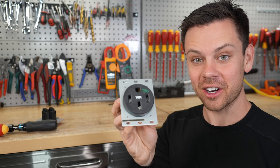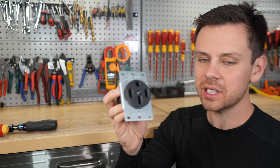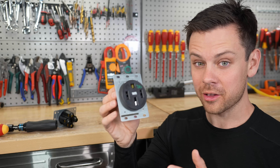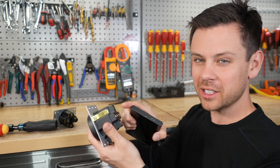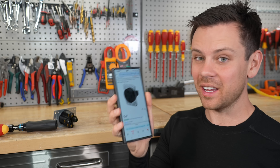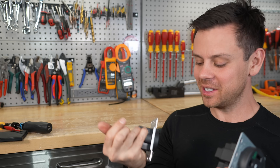If you do all of that, you'll be fine. These are very safe to use if you use the right one and install it properly. But please, do not use the $10 ones — a lot of people do. If you've seen an electrician installing one, tell him to stop. After having mine overheat, I'm never going to install these again — I swapped out all of mine. Also, if it's mounted outside, you want a weatherproof box. This one works well and is made by Leviton, but it has Phillips screw terminals and I really don't like that. My favorite one on the market right now is the Hubbell — it's $54, really easy to torque to the proper spec, and I think it's the highest rated one. I hope this video saves somebody's house, because this thing scares the heck out of me and I see it all the time. Thank you so much for watching.